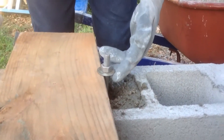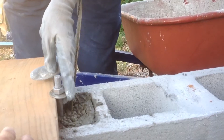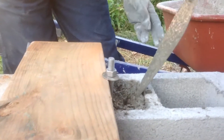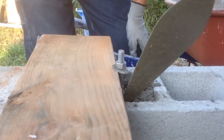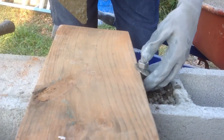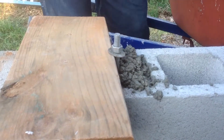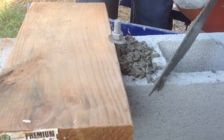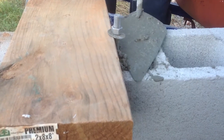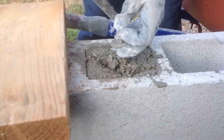We're going to leave that board there and put more concrete in around it. You just kind of have to pack it in there — it keeps your bolts straight. The pattern board, or measurement board, helps get your depth for the bolt perfectly and also helps hold the washer up since that washer is a pain. As you can see, she's got her hand on it, trying to keep it up out of the concrete while leveling around it and packing it down.